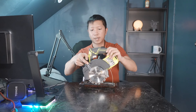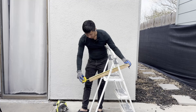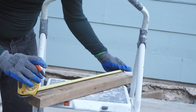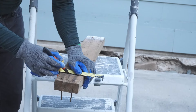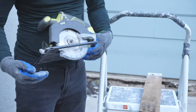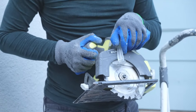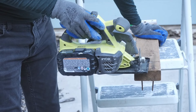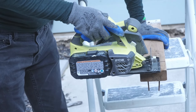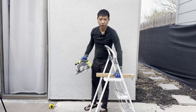Here's a quick demonstration on how I cut this 2x4. I want to cut out about 3 inches, so I want 21 inches. Get your marker and mark 21, then once more on the bottom — now draw a line. Make sure your blade is all the way down and there's nothing underneath to cut through. When it starts to cut, this guard is going to open up to cut the wood. Press the safety button, hold it, then use the trigger button on the bottom. And that is how you cut a piece of 2x4.